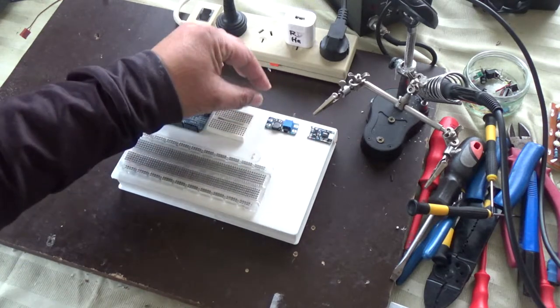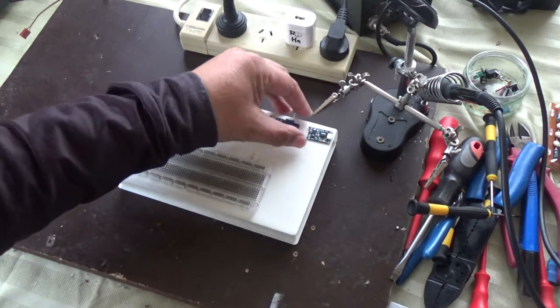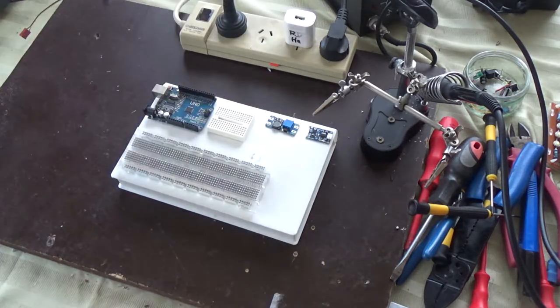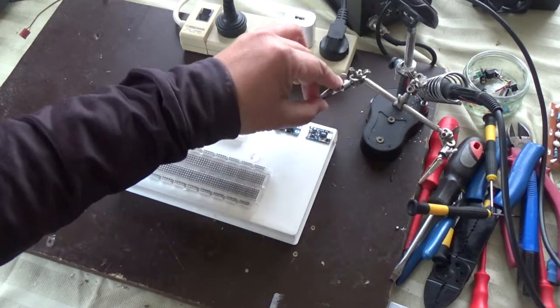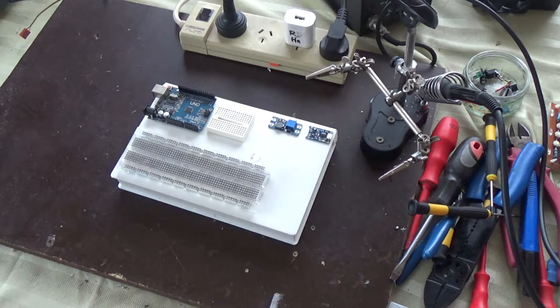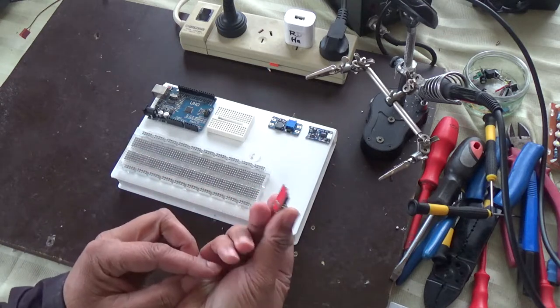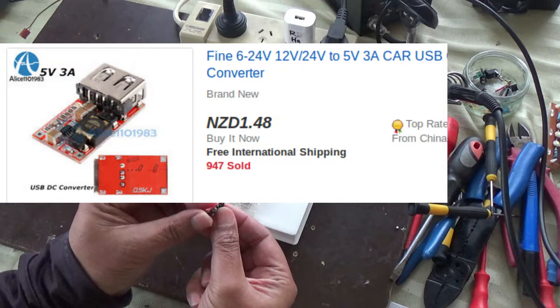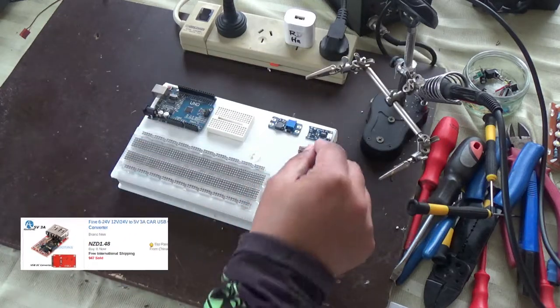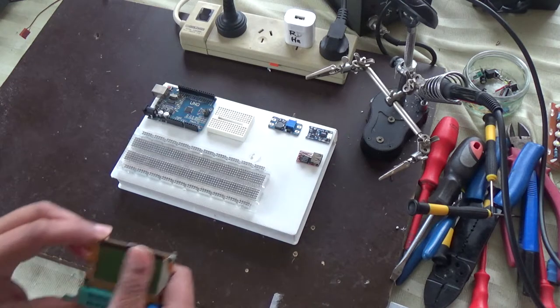the step up module. Now to drop the voltage back down to 5 volts for the Arduino and the circuits I create, I used a step down 5 volt USB module. This is a clever choice. I can tap into the module's 5 volt output that I need to supply the Arduino, and I also have a power bank to recharge my phone from the USB.